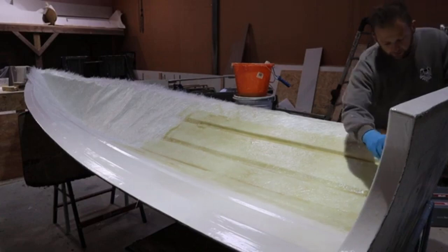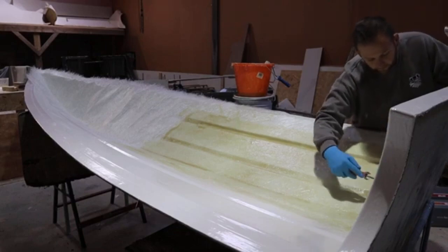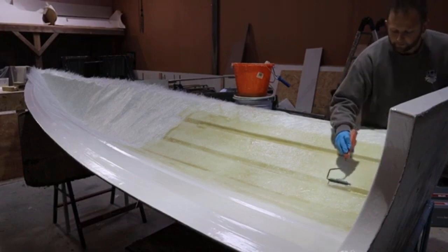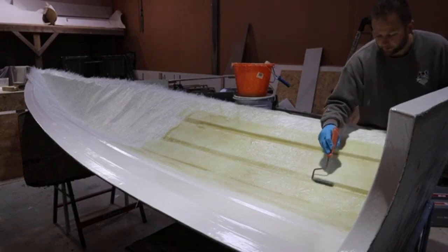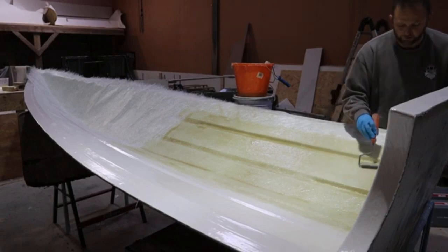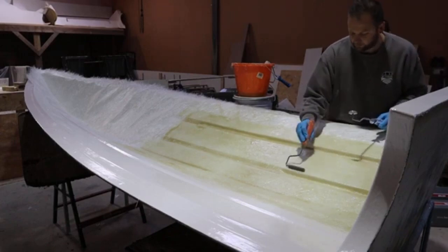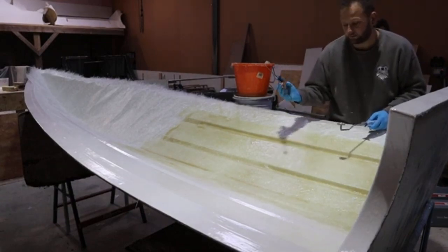All boats are built on good foundations, and a good foundation is that if you can get the gel nice and you can get the first layer nice, then everything else after that will fall into place and you have no issues. At some point there may be a small bubble of air trapped in the main laminate. Of course, over time that could cause an issue, but these are hand built. They're not machine built, so they're not machine engineered, CNC laser formed and all this sort of caper. This is made by a man and some washers on the end of a paint roller.